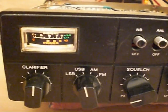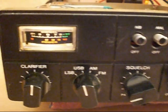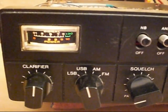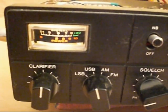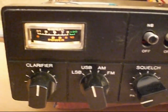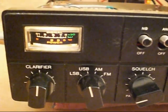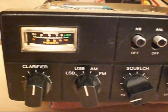This old Major here belongs to a friend of mine. I've done a lot of MOSFET conversions on 11 metre radios — what I've done is taken out the old 2SC1969 and replaced it with an IRF520N. It's actually peaking around about 25 watts PEP output, and I'm only using the standard microphone. If you get the modification right it works great. This is an old Cybernet boarded radio and the audio on it is probably among the best you've heard.